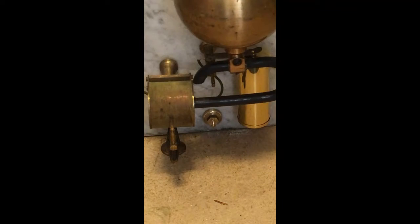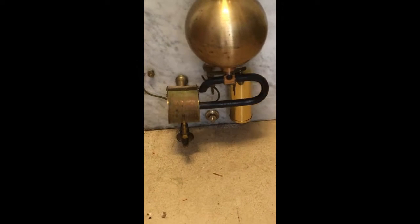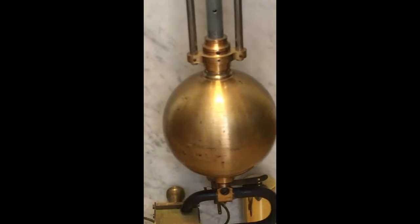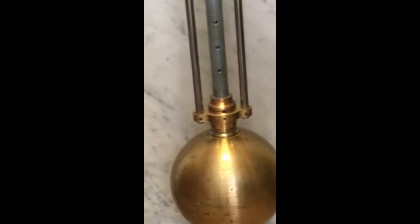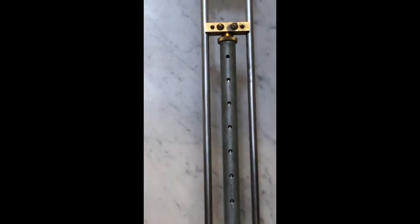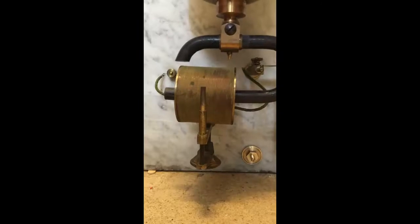Here's a view of the bottom of the pendulum — we're going to show the parts of the pendulum. The pendulum is a temperature compensating pendulum. The centre part is made of zinc, and the combination of the two downward steel rods and the upward going zinc rod, and that movable bracket in the middle which hangs in the rest of the pendulum, is the temperature compensation.